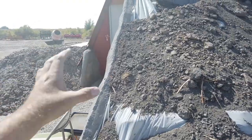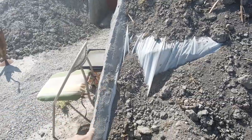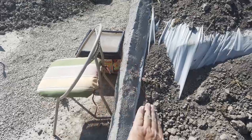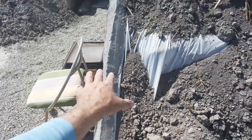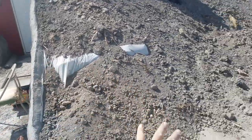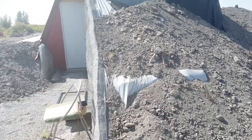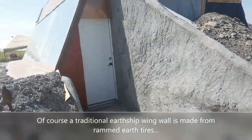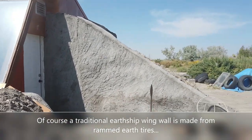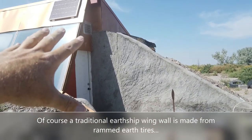We basically just spread concrete over it. I sealed the plastic underneath this edge of the concrete — this cap slopes that way and that way. This half of the slope has plastic under it, so it held really well. When water comes, it'll hit that plastic and drain off this way. I'm really trying to protect the tire bales so the cables don't corrode and break, keeping them out of moisture so they'll last much longer.